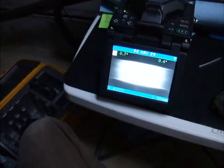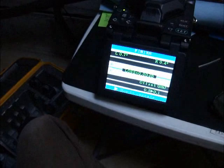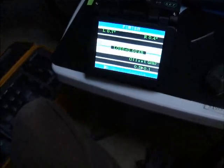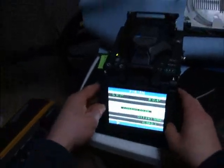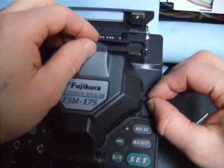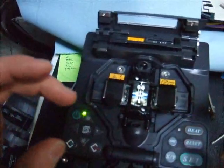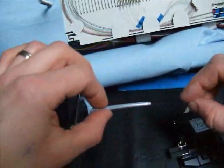It's very fast — pretty self-explanatory what you're looking at there. I'm not sure how it estimates the loss to be zero decibels. I guess the testing I'm going to be doing will bear that out or not. Don't bother to turn it off because we'll need it on for the heating — it just goes into a sleep mode. You can see the two sides kind of pull away like that. It calls that a proof test, and it stresses the fiber just a little bit in a very precise fashion to make sure that it really did take, or fuse, or whatever you like to call it.